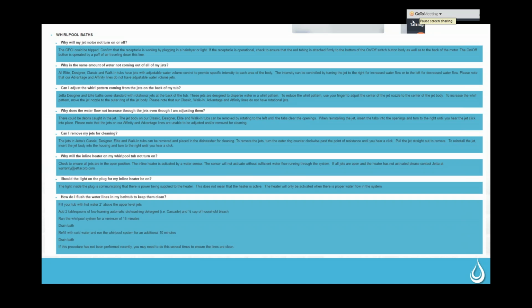We also sometimes get issues where people say that their button won't push down to go ahead and start. So sometimes what happens is when they're grouting the tubs, some little pieces of grout or debris will get down in between here, or it'll get pushed down sideways and get stuck because there's a little crumb of grout or something that won't come back up.